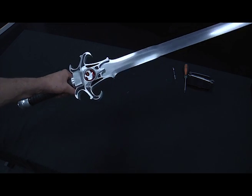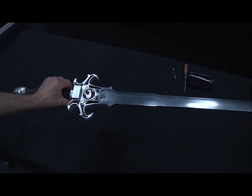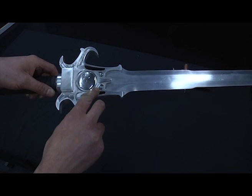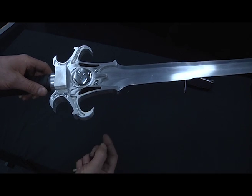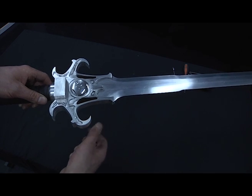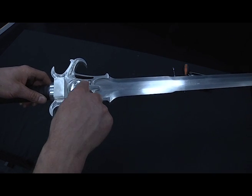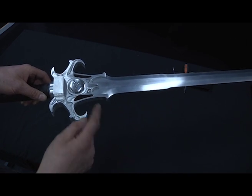It's all nice and shiny — it took a hell of a lot of sanding to get it to that point. The back side isn't finished, and there are a couple of reasons for that. One of them is these nuts and bolts going through there. The back was threaded for a screw that was the right width to go through, but basically the threads have stripped out, so I've had to put a bolt through. Until I get a slightly wider — probably a 5mm bolt — and recess it, using the blade itself as the threaded part, I won't be touching this.